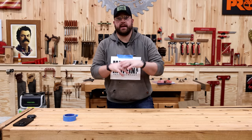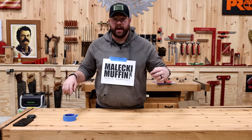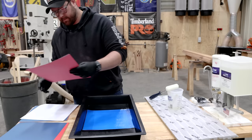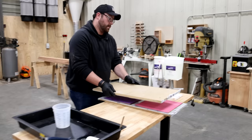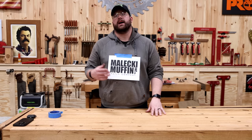The inspiration for this experiment is coming from a TikTok I did a few months ago where I used paper as a saw blade — we cut foam, other paper, and some wood. But this time I really want to beef it up and see if I can make an actual real working saw blade. The first thing I'm going to try is taking each sheet individually, putting it in a mold so it doesn't drip everywhere, then vacuum pressing everything together to get as tight a bond and as thin a sheet as possible. Typical saw blade kerf is around one-eighth of an inch — I'd like to be close to that.